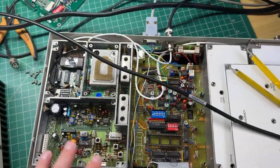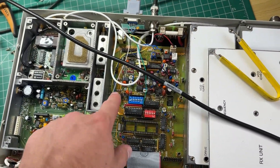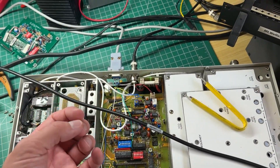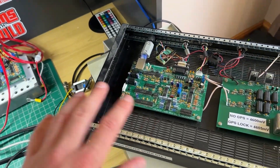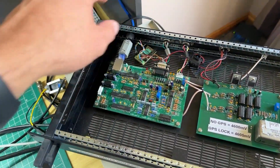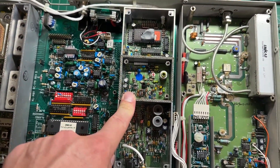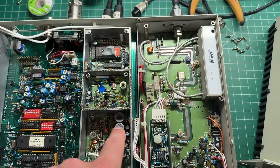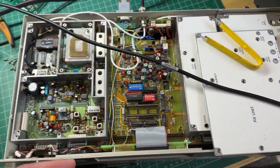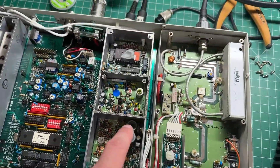This one's not connected up to this board yet - I'm just going to be doing that next. But this one's already been done, so I changed the frequency reference of that. And then what happens is we take discriminator audio out of the receiver - that's just basically white noise straight out of the receiver with no filtering whatsoever. That goes into the voter, or each of the voters. That way it can determine from just pure noise which one has the strongest signal. Then it outputs audio back directly into the top of the modulator in the transmitter exciter. We also have to do that after all the filtering - there's all this filtering in here when it's used as a normal repeater. We don't want to use that because if this is set up differently to that one, the audio will sound funny and the phase will shift in and out, and it does not sound very good at all when you're in range of both repeaters. So we bypass all of that.